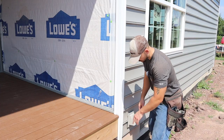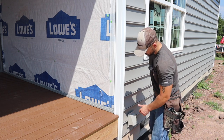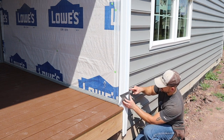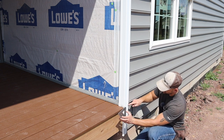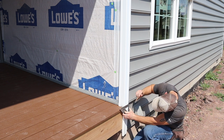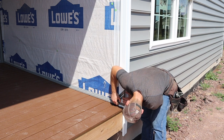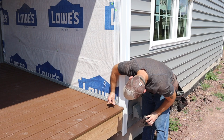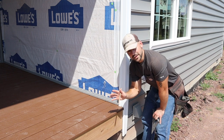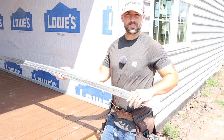As you can see, the deck is a different elevation than where the siding started on this wall, but you want to line the siding up with each other. To do that, take a speed square and eyeball it to the bottom of the run coming across — best to use the one closest to the top of the deck. Slide it until it lines up with the bottom, make a mark here, and transfer the mark over. Now we know the bottom of our starter strip needs to be in line with that mark, which is why I installed J-channel around the whole deck to hide the bottom of the siding.